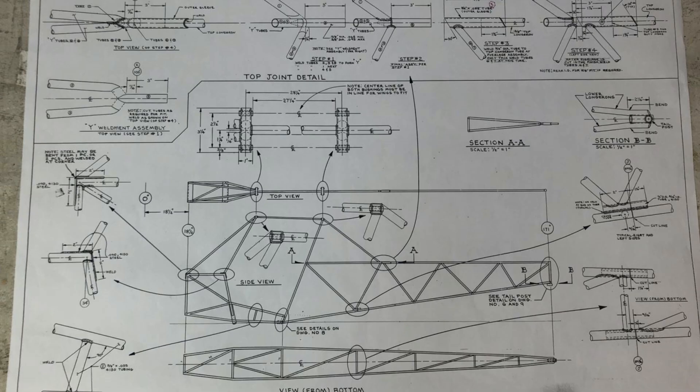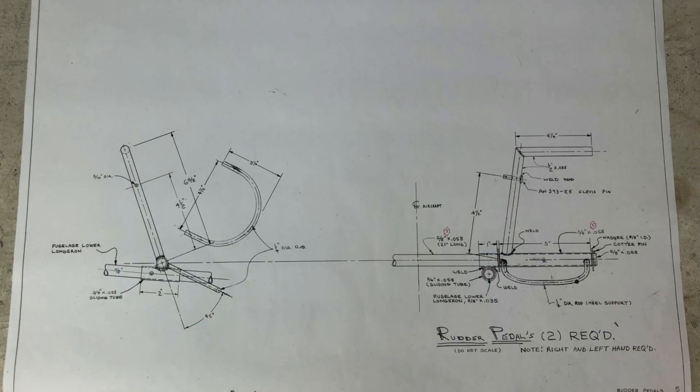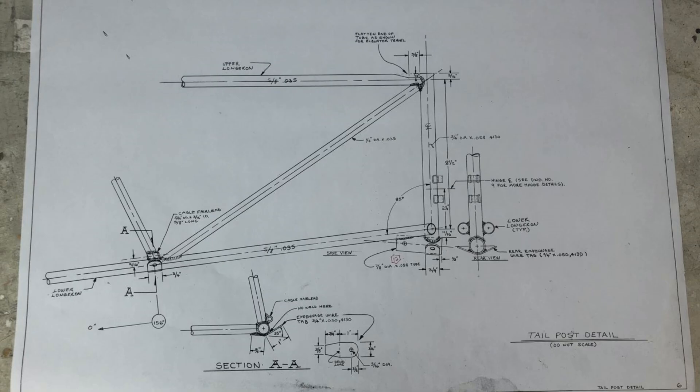Memorize every one of these drawings — even drawings for pieces and parts you're not going to use, like the floats. When you go to start cutting the metal, understand that if you don't have an easy way to cope and make the joints fit really tight, you're going to be doing a lot of grinding. I tried five or six different methods for those copes; the only thing that finally worked for me was getting it close and then grinding it. You want that joint to literally not be able to let a piece of paper slide through it — that way when you go to do your TIG welding, you don't have to learn how to fill the gap. I did learn how to fill the gap because some of these parts were a real challenge to fit.